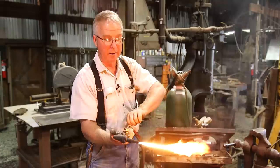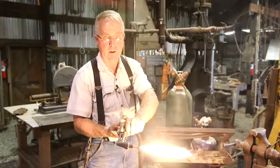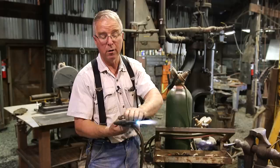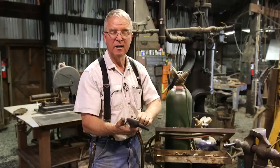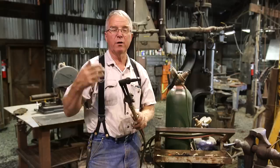Now let me show you what happens when you do not shut it off in that sequence. Remember, this is on, I crack this valve, it's lit, I turn that on, I hit the lever, I give it a little more, and if I shut off the acetylene, did you hear that little snick? Sometimes it's a pop. Sometimes it will pop when you shut the fuel off first, and that creates some pressure and pushes soot back up into the tip, and it's not good. So you always just reverse the sequence. Oxygen off first, acetylene off second.